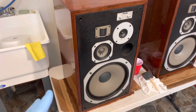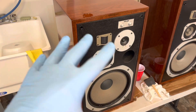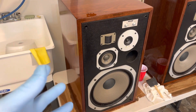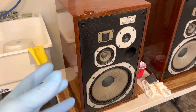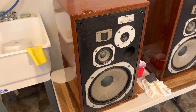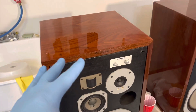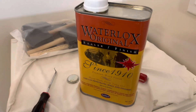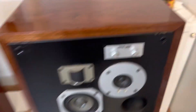These ones had some pretty bad dinged-up cabinets. There are still some scratches because I didn't do new veneers, but these ones had a very mottled finish — splotchy, shiny in some spots, very dull in most spots, and the finish looked pretty terrible. So I sanded down the veneers without going through, and now I'm using this Waterlox product, which I'm a big fan of.